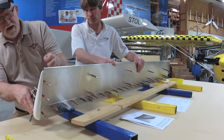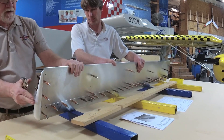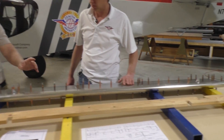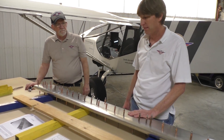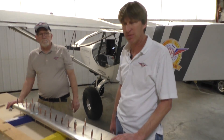Now you've seen us put this together and the only two places we used a drill was on our cosmetic wing tip and on the brackets, which is where your attachment point is to adhere it to the airplane. So that's pretty much a complete section now. So now we're ready to start riveting. How long would that take — riveting this section together?